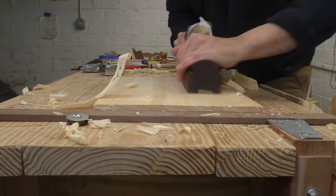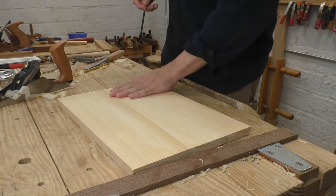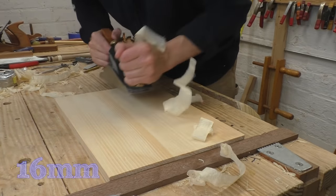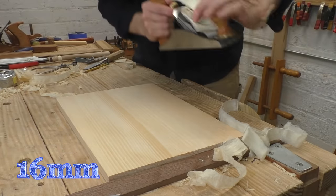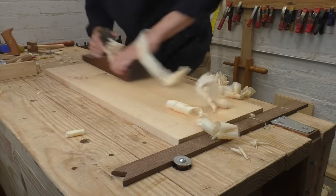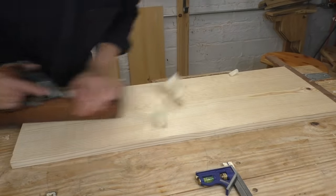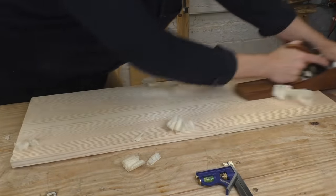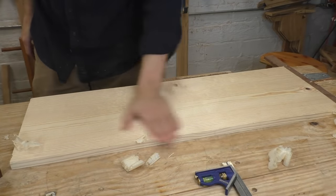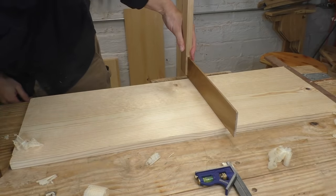So I'm going for a compromise. I take down the hump in the middle of each board and then flip it over to work the high spots on either edge. It's not going to be perfect, so I'm shooting for a finished thickness of 5 eighths and boards that are flat enough to join together. If you can find thicker lumber, I recommend it. But with a sharp iron, you can get a lovely finish. This white pine is soft and fragile, and I notice that my bench is covered with dents, bumps, and little bits of dried glue — this rough surface is going to destroy my freshly planed stock.